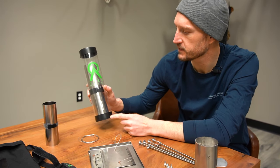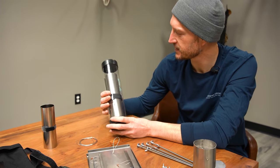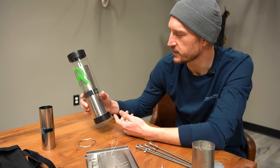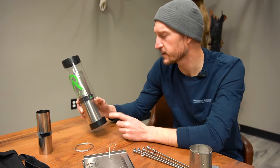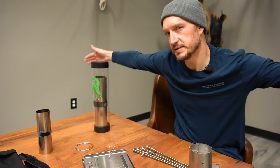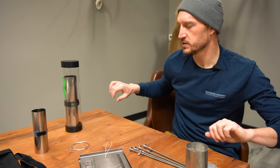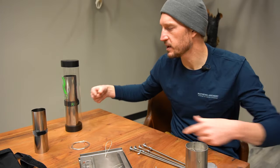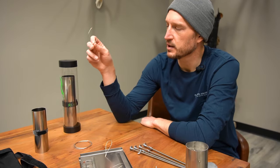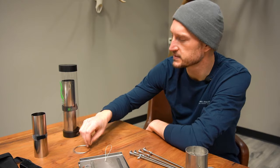With this little Cub U-turn you get a five and a half foot pipe. Typically you get this in the mail, pull it out, and you think how does this make itself into a stove pipe? Essentially what you're going to do — I would recommend checking our library videos on how to initially do this — but you roll this pipe out long ways, take a broom handle, and it helps if you've got three or four people the first time. Roll that pipe around the broom handle so that you've got a nice round long five and a half foot pipe. You're then going to take the pipe rings and install those, slide them over the pipe, evenly spaced throughout the distance of that pipe.